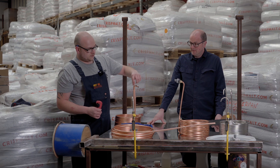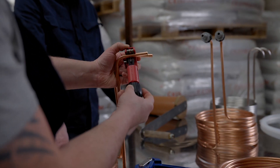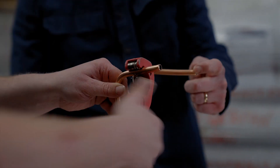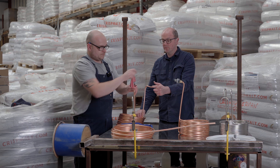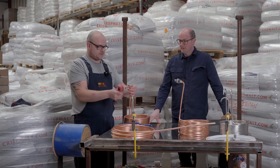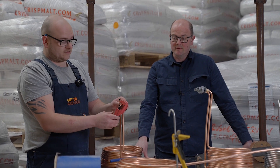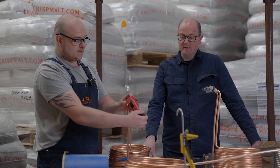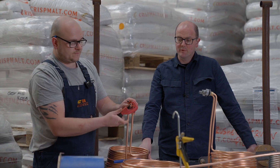I'm going to cut these little bits down to size now so they're not sticking out too far — maybe about two inches. Bring it out, then just let it gently go on, give it the first couple of spins, and tighten it up as you go around. Take your time doing this bit because it makes it a lot easier when you're trying to get the fittings on — just oscillate or turn it and tighten every now and again by hand. I'd recommend getting one of these pipe cutters as it leaves a very clean cut. I wouldn't recommend a hacksaw because it leaves shards and bits in the pipe, whereas the pipe cutter leaves a nice fresh cut and it's easier to fit your brass compression fittings.